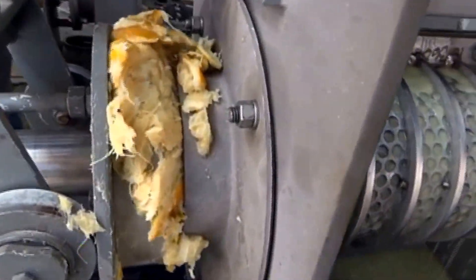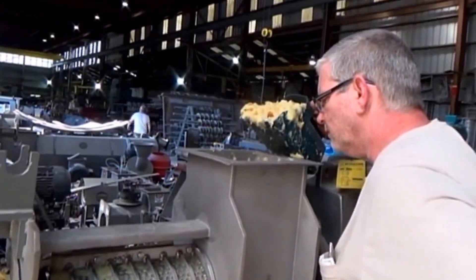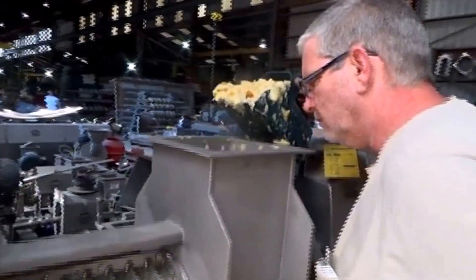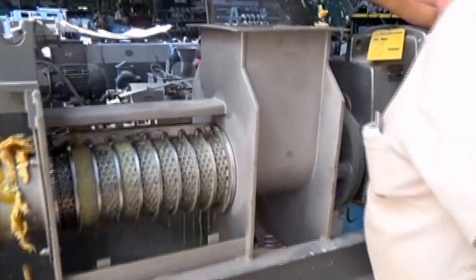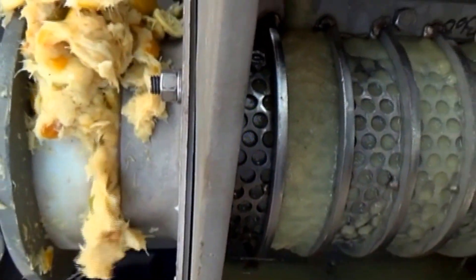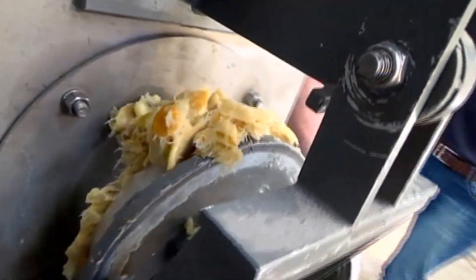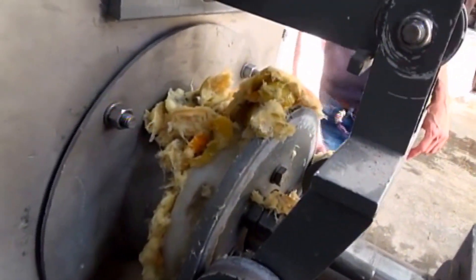Cake coming out. It's too hot to squeeze. We're keeping a level slightly over the top of the screw. Now you can see the screw turning — it's covered over at the inlet to the screened area. That's important. We opened the cone a little bit more. On the other side it's channeling, but we'd expect that. We could get a better fitting cone.